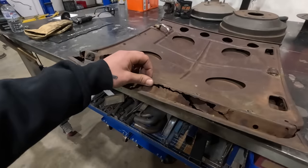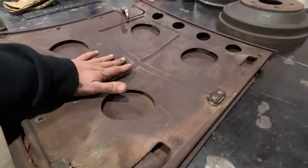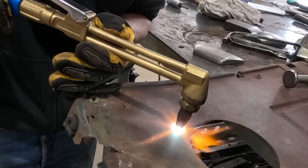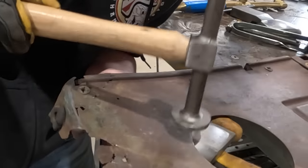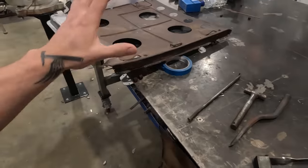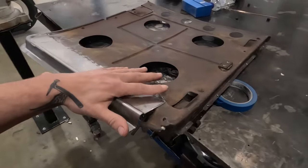In this video, I am working on a ton of different techniques to try and repair this door. I'm talking about this thing is crumpled. It is so rusty. We've done hammer and dolly work that I'm explaining during the video. We've got heat shrinking. We've made special tools to do all kinds of work during it. So you'll see me make all the tools that I'm using to separate the door skin and repair the rust